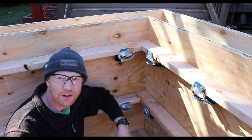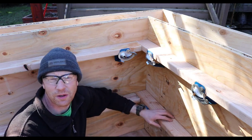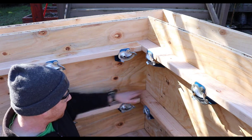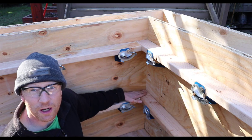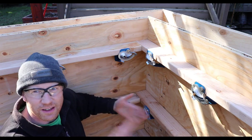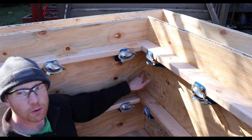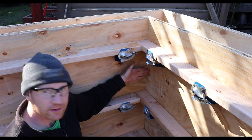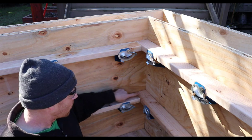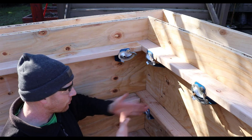So we looked at our outside corners, reinforcing those, and also the end caps, how we reinforce those with blocks. At the inside corners, you could put another piece of 2x4 across the top of this joint, but basically the forms can't go anywhere at this point. This form here can't push this way because it, number one, has this piece of plywood pushing up against it continuously. It also has this 2x4 whaler pushing up against this 2x4 whaler. So there's really no way for it to go.